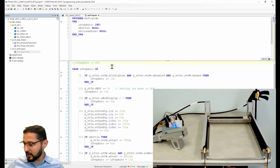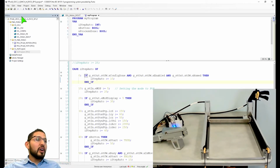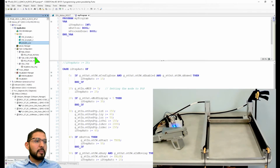Oh, I see a comment now. The task. Yes, Ronnie. Yes, I created a program, but I'm not adding it to my PLC tasks. So the PLC is like, I see that it exists, but you're not telling me to execute it, right? So I don't care about it. What I need to do is log out and add this program, or call this program, from my PLC task somewhere here, right?